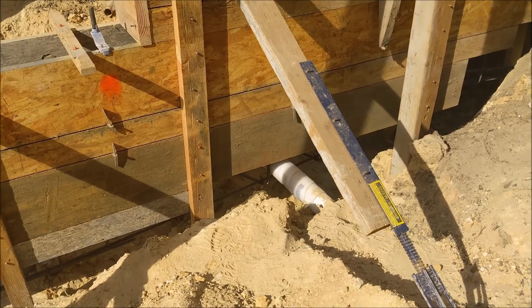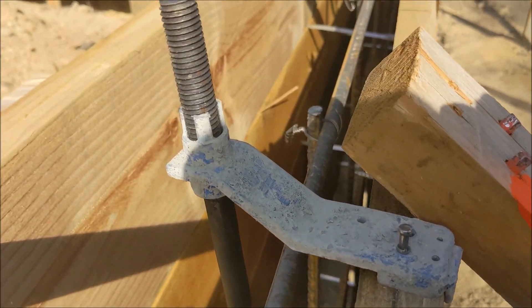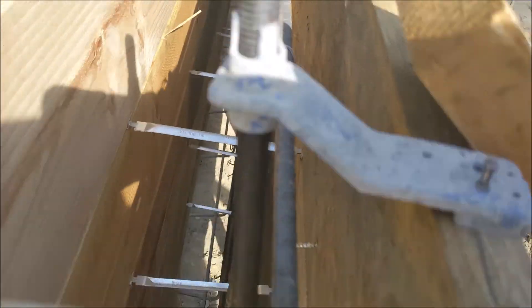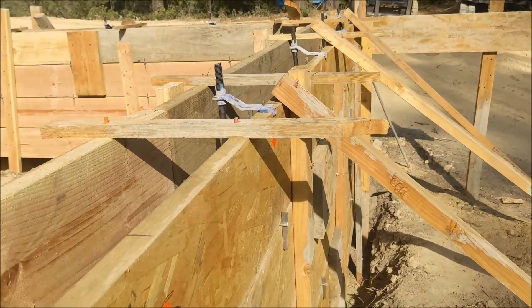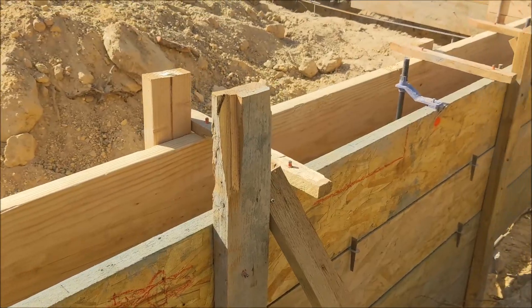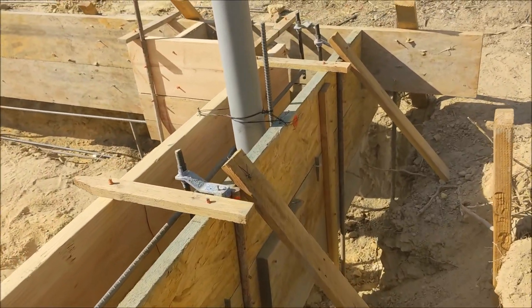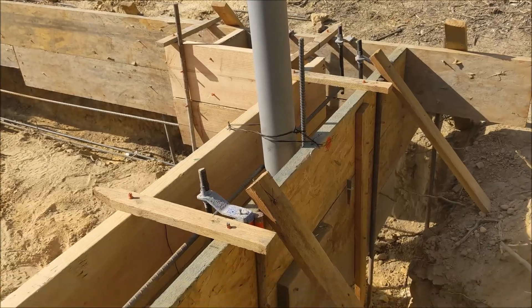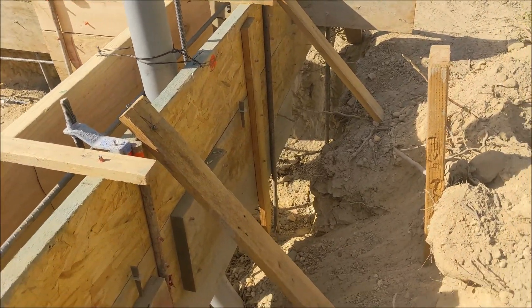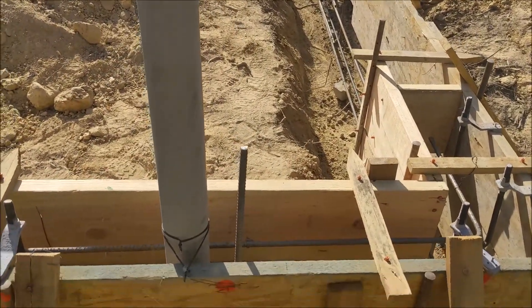There's an inspection from the county before you pour, and then also again before you pour the slabs. These are the anchor bolts that get put in. A lot of times the framer in charge is putting in the hardware into the foundation because he's the one who's going to be putting the sills on top and bolting those sills down to the stem wall. So these are all of the foundation bolts — this house isn't going anywhere in an earthquake. It's really a little overkill, but I'd always rather make it too large than too small.